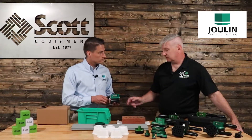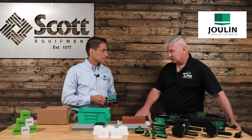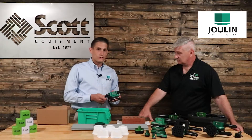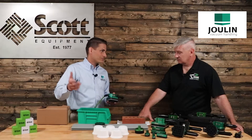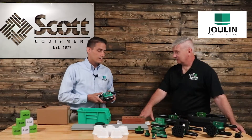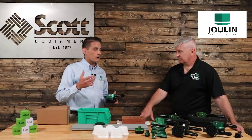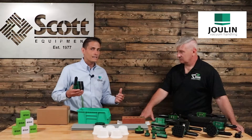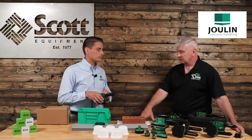So I can actually pass through sawdust, corrugate dust — pass through the vacuum gripper, no filters, straight through and out. That's exactly right. On our larger systems, all of these are using Venturi to generate the vacuum using compressed air, but we also have large regenerative blower systems. On those systems, if it's a high dust or high debris area, we pass that all through the entire system. We've actually got a lot of systems in the field in areas with a lot of sawdust. Sometimes after a year we'll take the gripper apart to blow the sawdust out of the frame, but that's very rare, and we can alleviate that stress by capturing it in a Solberg style filter between the blower and the gripper.